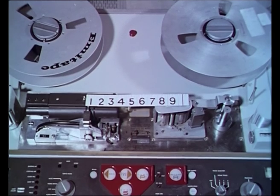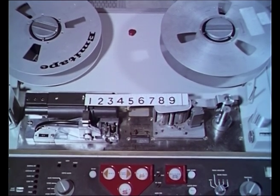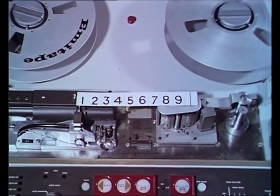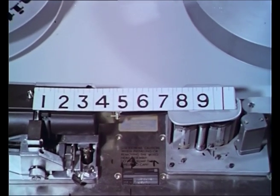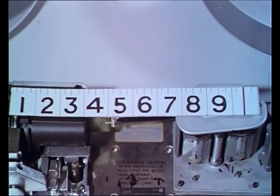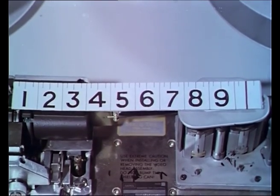This means that although the sound is recorded and played back simultaneously, its position on the tape is in advance of its corresponding picture. This displacement between the sound and vision signals is 9.5 inches, which produces on the tape a separation of about 0.6 of a second.